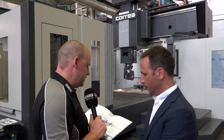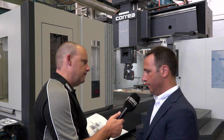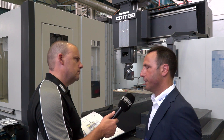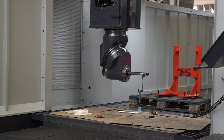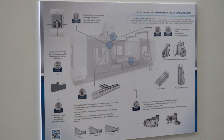So in the brochure, Pedro, we're talking about precision, robustness, reliability and flexibility — are those four points that really summarise this model? Yes. In fact, this is our UAD head — a long experience head. We have a patent because we have a system of a double Hirth coupling. We have the standard Hirth coupling of two and a half degrees, but in this case a double. The difference between those Hirth couplings is 0.02 degrees. So we have the rigidity of the standard Hirth coupling system, but with many more positions. We have both rigidity and positioning.